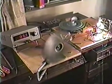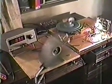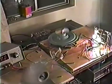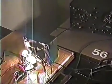Okay, now for this second demonstration, here we have our 120 volt fan again, rotating finely, stirring up a breeze. Right behind that you see a 24 volt DC motor. In front of that there is a little rectifier, a little box here. This is a rectifier. This is a transformer, dropping the AC power down to the 24 volts. And you can see there are two 12 volt lamps in series, brightly lit, showing you that yes indeed we have the full 24 volts.